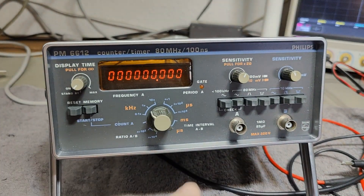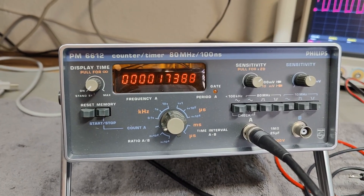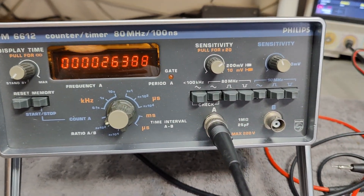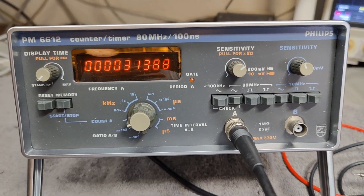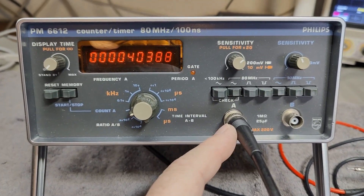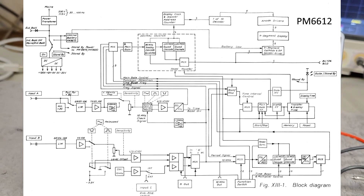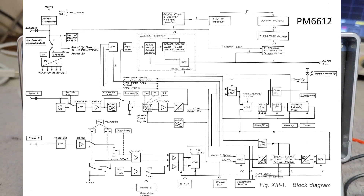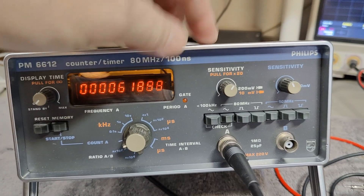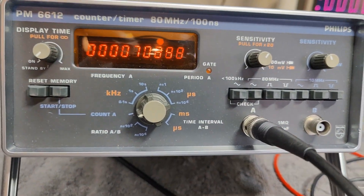We have some problems with gating. One of the most important things we learned when studying this unit was to do a proper front panel test and survey, and come up with good ideas of what is working and what is not — even things that work tell us not to waste time in different parts of the circuit. In count mode A, with a 1 kHz signal on input A, it is just counting, not using any gating or time base. Since counting and sensitivity both work, that tells me the input stage and all the input circuitry that converts the analog signal into a digital countable signal — and also all the counters — are working. That is really good news.